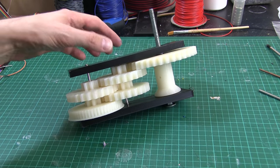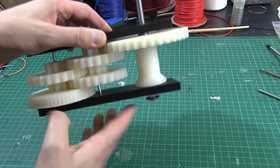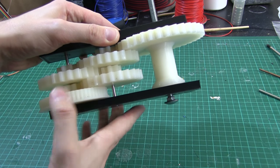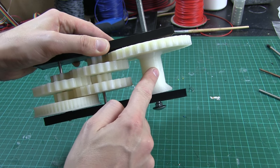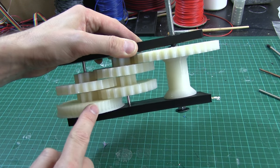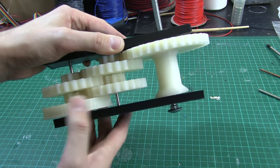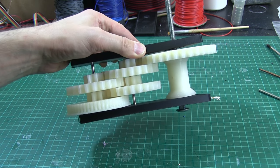Here's my next test assembly — I've got the big gear in, and of course when I turn this they will turn rather well. I think I've got that spacing just about right. This gear is mounted on bearings top and bottom with an 8mm bolt through. That seems to work — you can see it turning. This little pulley here pulls the cord that goes through the blocks and tackles, so if it's too slow I can move these around and perhaps drive this gear driving this gear driving this, to speed it up by a considerable amount. We're going to make a plate now to mount this in the arm.